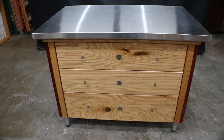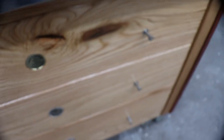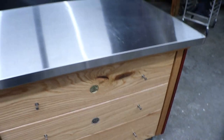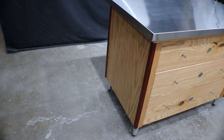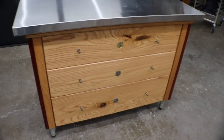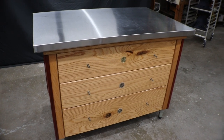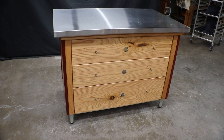Here it is, all finished. The only thing I haven't done yet is replace the plastic leg pieces with metal ones — they haven't shown up yet. But it's all done. Got these little Texas Star stainless steel pull handles, and I put my little shop logo on it. Three drawers. My customer didn't want pegboard on the side, so I left it all plain oak. Mr. Berto put the sanding sealer on it and two coats of urethane gloss. That's how you can build a workbench using a restaurant table and get yourself a stainless steel top for very little money.